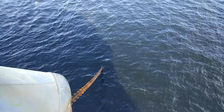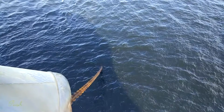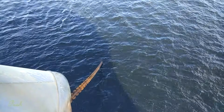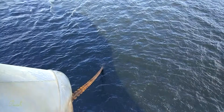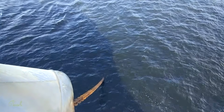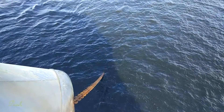The cable is stretching. Slowly this long stay chain will become short stay and maybe up and down — at that stage we can call the vessel as properly anchored. Now we have six shackles in water and there is a slack in the chain. The vessel is turning into its position as per the wind and the current.